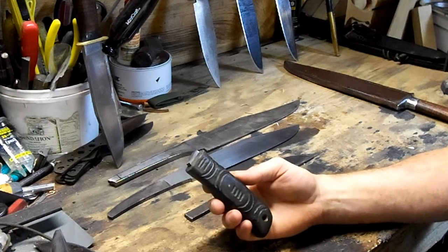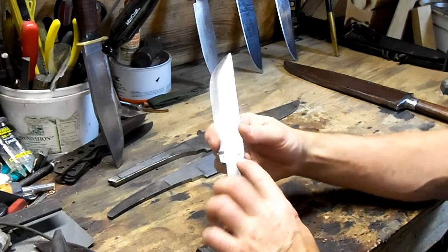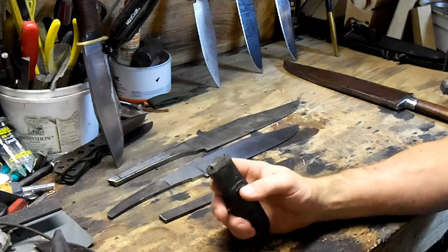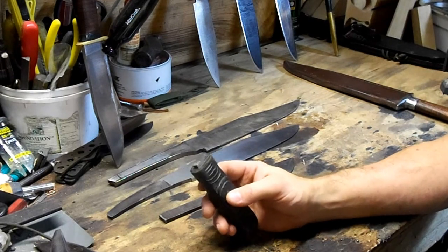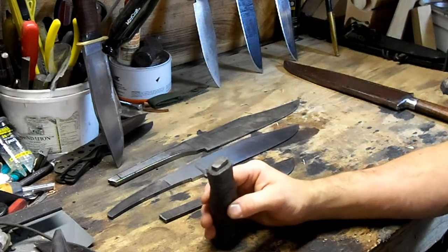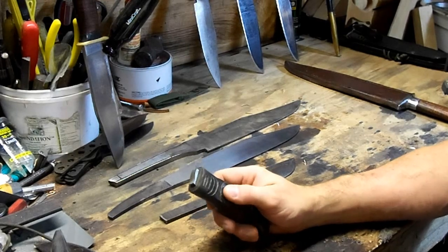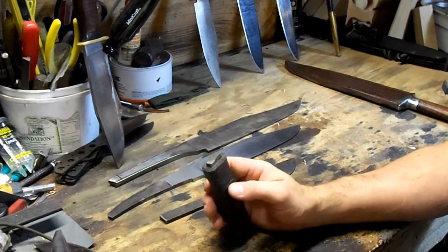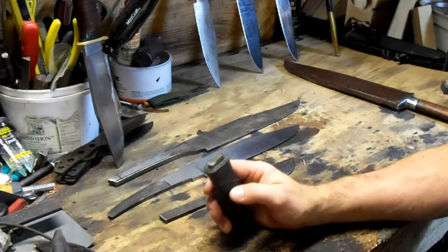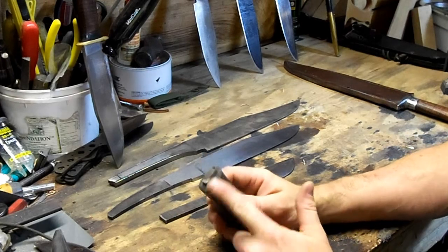This is the handle of a Cold Steel Trail Master that I used for many years. It was my go-to knife for everything, and it broke off right at this area doing a fairly light job — ping, the blade just dropped right off, and I was extremely shocked. I'm not saying the Trail Master is a bad knife; I've owned several and really like it as a go-to production bowie knife. But don't think any knife is indestructible. The knives I make aren't indestructible — give me a pipe and a vise and I can break any of them. Just be aware: with this type of tang, this is the issue you're going to come up with.